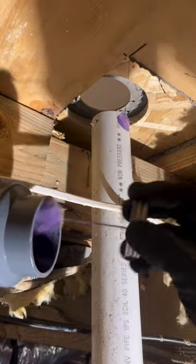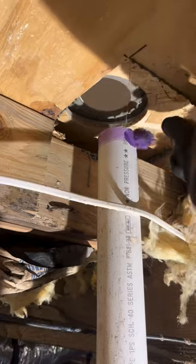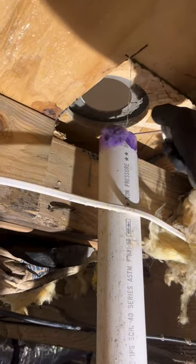I haven't really ever had issues with putty, but I'm always open to trying new things and improving what I do. Once I prepped the top, I go back down to glue on the shower drain. I probably could have done this before I went up, but I needed to get my steps in for the day, so that's my excuse.